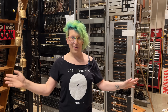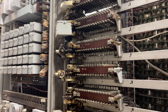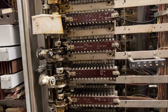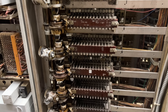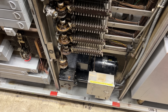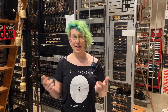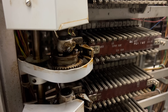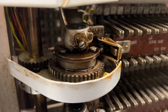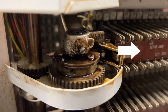Time to drop everything and work on that. In electromechanical switches, the interrupter works as kind of a master clock. Various circuits around the switch need regular pulses to complete some of their functions, such as flashing a lamp, timing for billing, or waiting a certain amount of time for something to happen. Without those clock signals, part of the switch will just fail to work. In panel and number one crossbar circuits, the timings are all pretty bespoke, so there are many interrupters, each driven by their own cam and gear sets. Each cam has a follower wheel that opens and closes these phenolic bars, which in turn open and close their contacts.